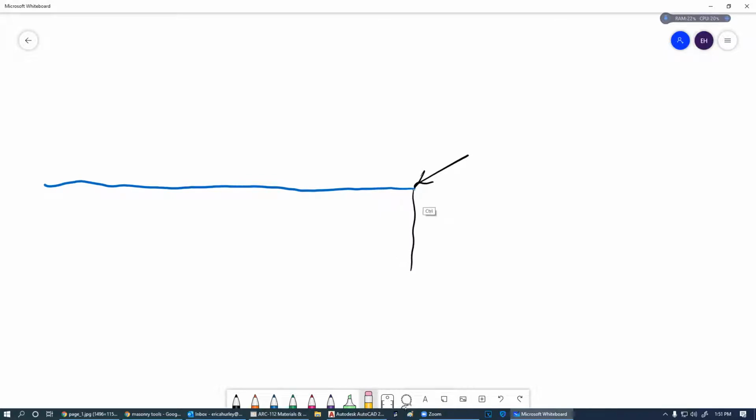We want to put an edge on it, and it's just a round over. It makes a nice smooth edge for that concrete. It won't allow it to break off. And it also looks good if we step on it with bare feet or fall on it. It's not going to cut us.